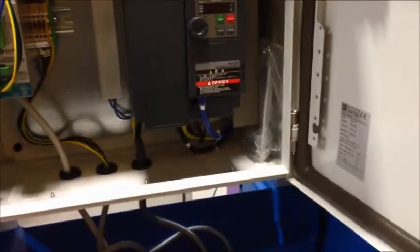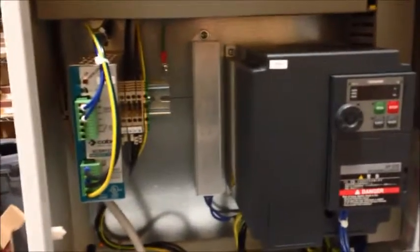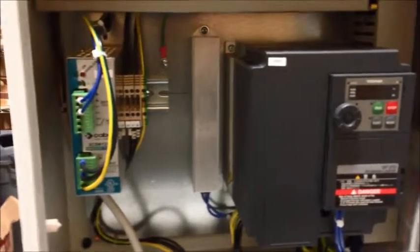The electrical cabinet has a frequency inverter for the main motor for a quick stop, a Toshiba, and it has all CSA UL approved components on the inside, a Klöckner-Moeller main contactor, then actual motor starters from Eaton, and fuses, the main switch, a regulated 24-volt power supply. It does not have the e-stop relay in it. That you may have to retrofit. And then you see here on the side of the inverter the brake resistor so that we can stop fast. Okay, anyway,